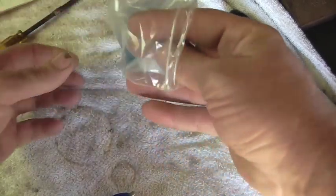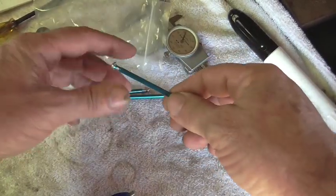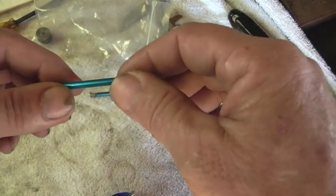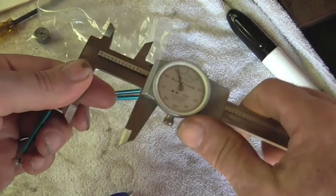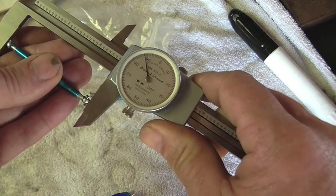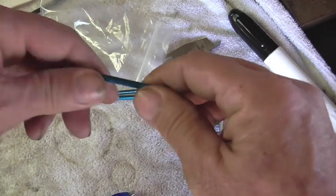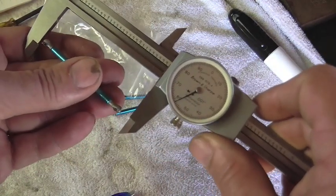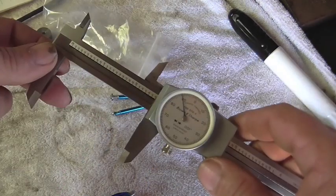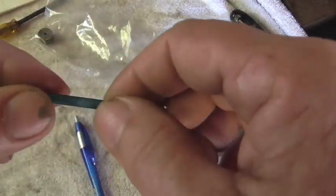I had a crazy little job come into the shop. It's not something I wanted to do, but a young kid with an RC car needs some parts modified, and he was willing to give me some decent money. What we've got to do is cut this thing in half, shorten each half to 29 millimeters, then machine a couple of sleeves for both halves to slide into. I got a measurement of 2 inch 590, divide that in half, mark it with painters tape and cut with a Dremel.